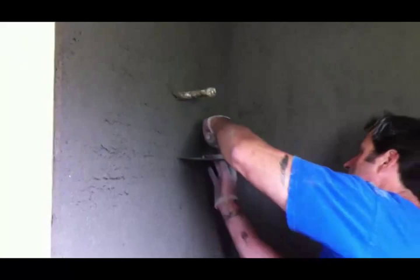When you take out your strips, they leave voids and you just throw in some more fat mud — nothing to it, just fill it up. Then you take your flat trowel and go along the wall to get off all the excess. I'll just go right up the wall and make sure I get off all this excess mud — that makes it super flat. Keep the steel trowel flat against the wall and you won't dig in.